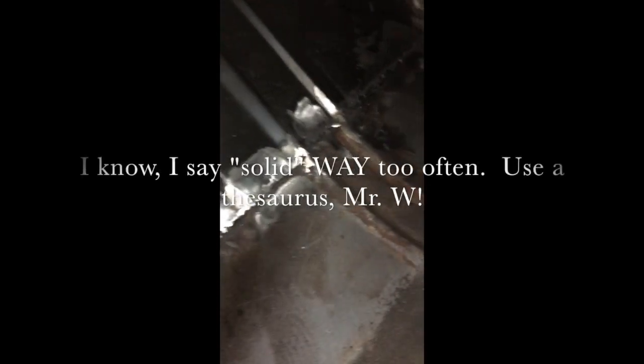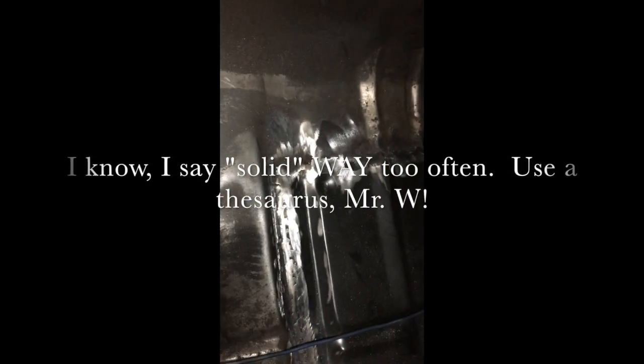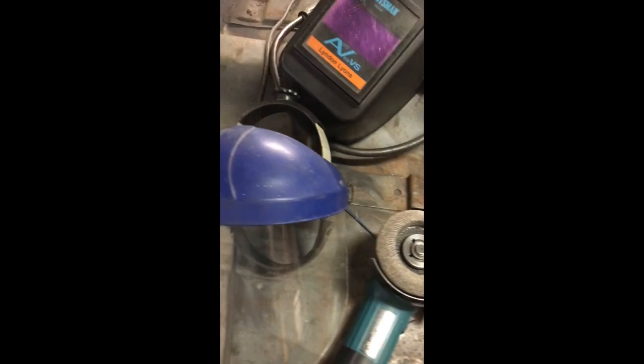I still left a little bit of a ridge, but I actually welded on both sides — I did this side and then flipped it over and did the other side too, even though I was getting good penetration. So it's really solid. I hardly had any pinholes to go back and fill at all. I don't know what was more work — the welding or the grinding — but it has been something else.